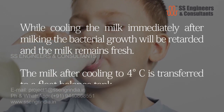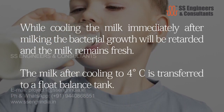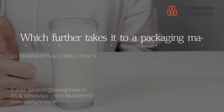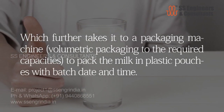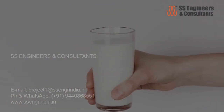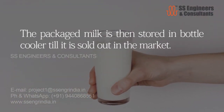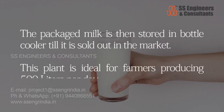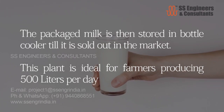The milk, after cooling to 4 degrees Celsius, is transferred to a float balanced tank, which further takes it to a packaging machine to pack the milk in plastic pouches with batch date and time. The packaged milk is then stored in a bottle cooler till it is sold in the market. This plant is ideal for farmers producing 500 liters per day.